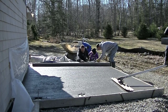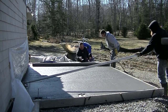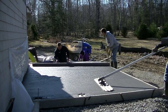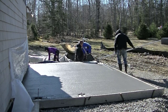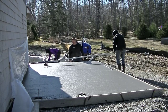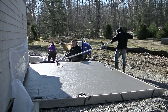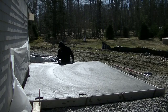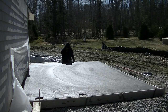When you're doing a stamped concrete patio you want to make sure, especially exterior like this with no roof over it, that it has good slope. The pattern itself will give you small highs and lows which are going to collect water. So if you don't put any slope to it you're going to have a lot of puddles all over it. Even with 2 inches of pitch over 10 feet like this, it'll shed most of the water, but you may still have some small tiny puddles here and there that just need to evaporate.